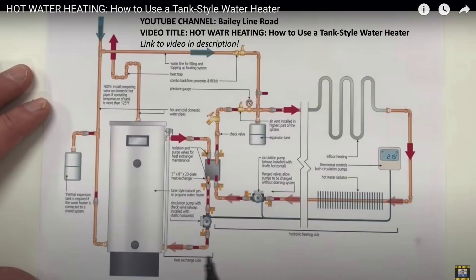What we decided on is a hot water tank that runs dual purposes: it provides domestic hot water and also has a zone for baseboard heat. The idea is we don't need a boiler — we'll use a really good quality hot water tank. There will be plenty of BTUs in that tank to provide hot water for the house and for our heat, since our heat demand is so low. Even at 140 degrees, which is much lower than a boiler normally runs, it's fine to run through our single loop and heat the house because we're only ever heating 10 to 20 degrees.